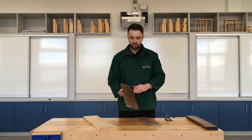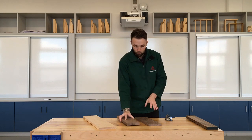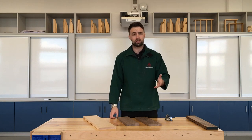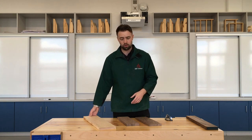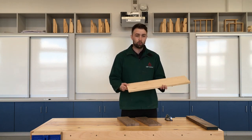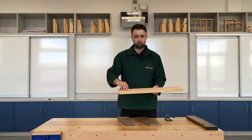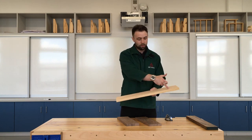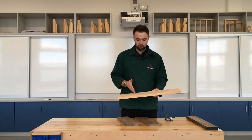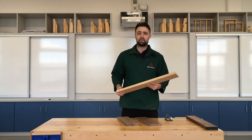What I did there was plane the face and one edge of the walnut on both pieces - that's going to be very important when I go to rip the strips on the table saw. The maple didn't need planing as it was already done. What I'll do now is cut that to about 400mm so I can keep some for another project, rather than ripping a full strip that would be essentially useless. Then I'll rip all the strips.